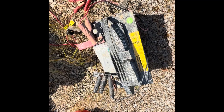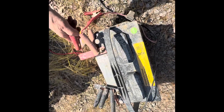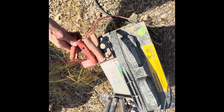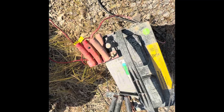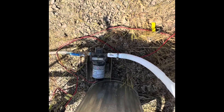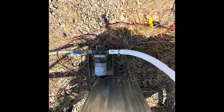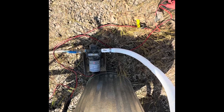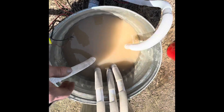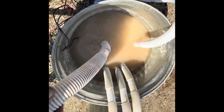We'll begin operation of the Gold Drop Miner by clamping the battery clamps to their positive battery posts. One operates the 12-volt pump, which is the wash pump for washing material through the screen into the gold drop, and the other one is for the pump that is actually pumping the water through the gold drop.